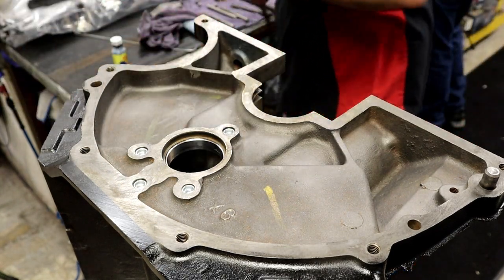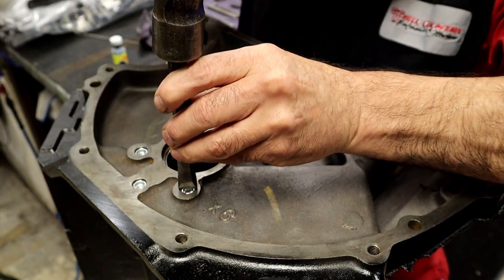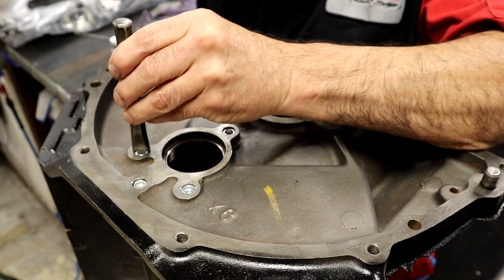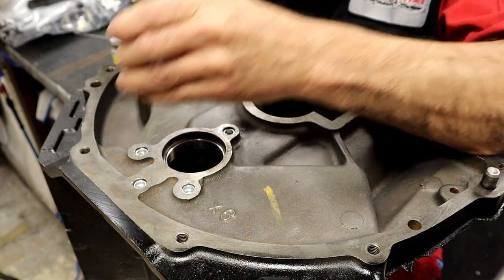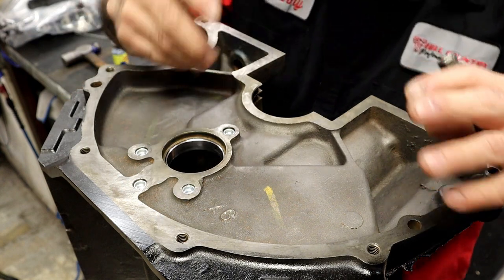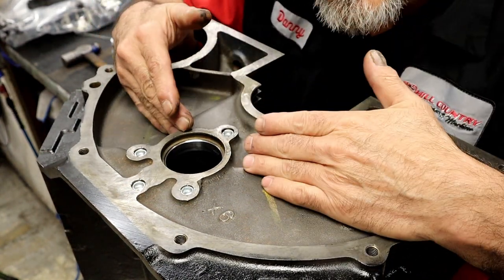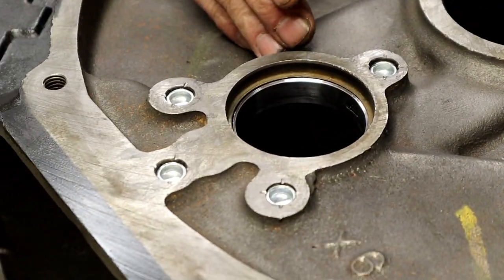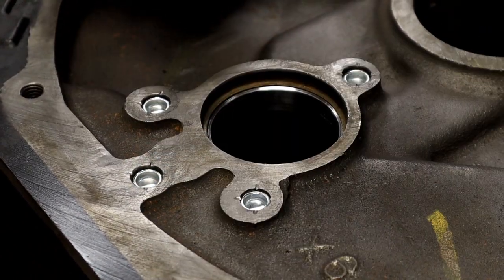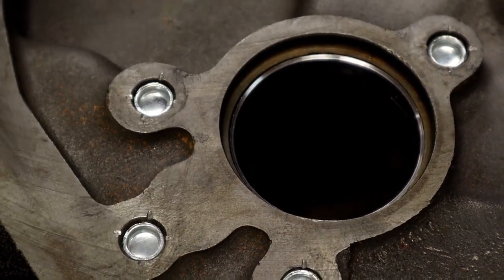It's the swaging tool — a chisel that I've rounded the edge so it's not real sharp anymore. Go right there. Done. Easy. They're not going to come out. Let's zoom in. Look at that — they look like the factory ones. They have little swage marks. All we did is move the metal. We've swaged the ends, and all that did is move the metal in. It can't pop out even if it tried.